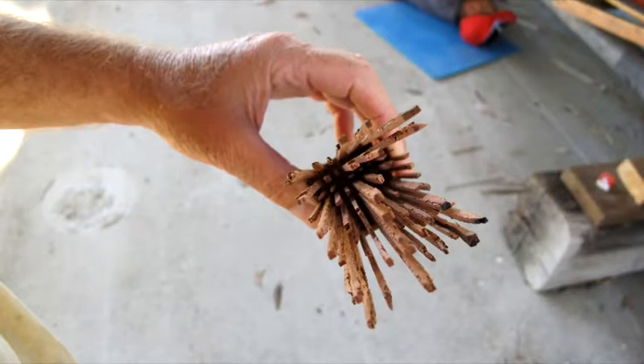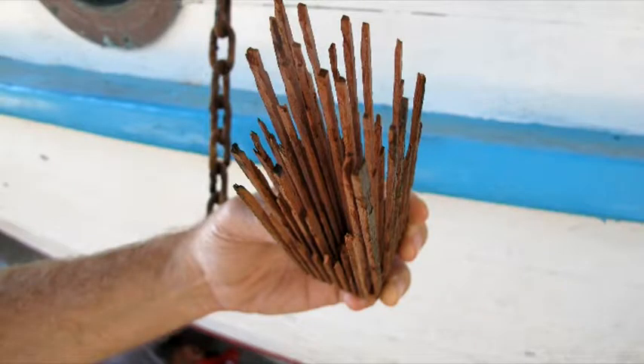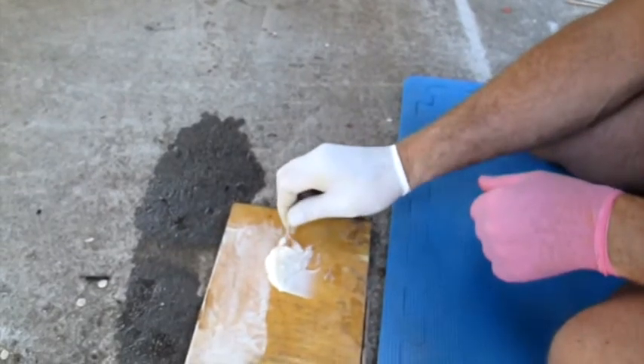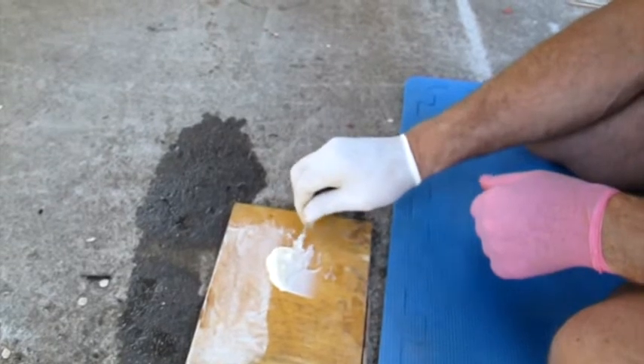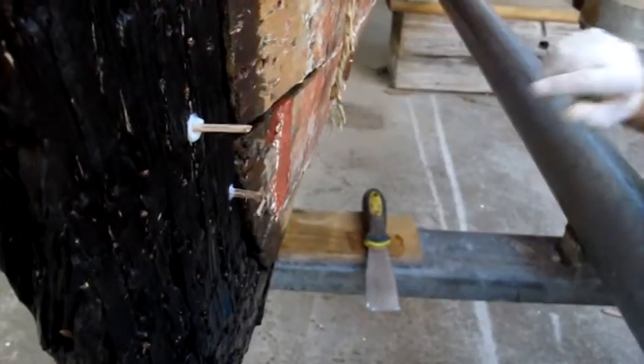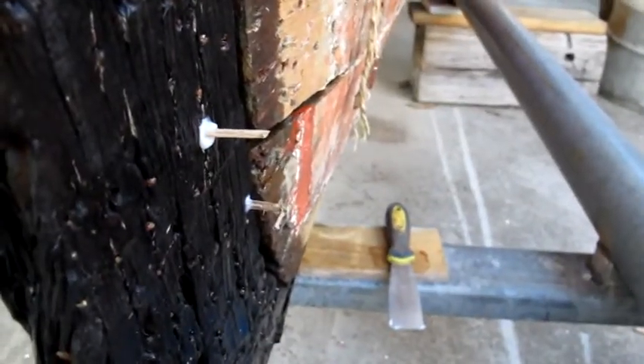The shaft holes where nails had been removed required plugging before the next stage. Plugging is inserting and securing especially prepared shafts, with each piece given a coat of epoxy glue and then tapped in. Here, one of the many plugs is prepared and inserted into the cut water knee.